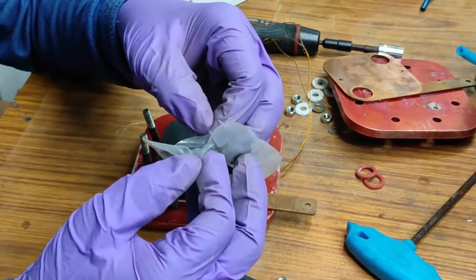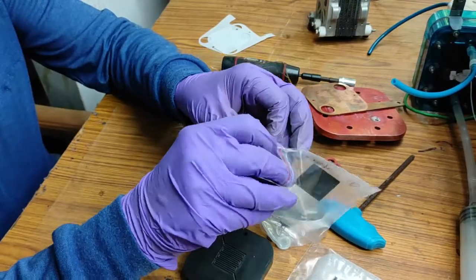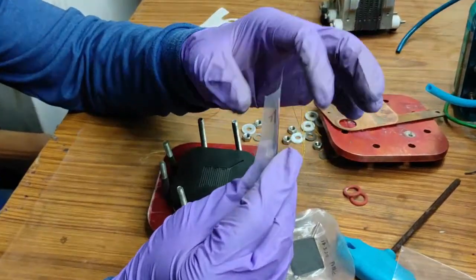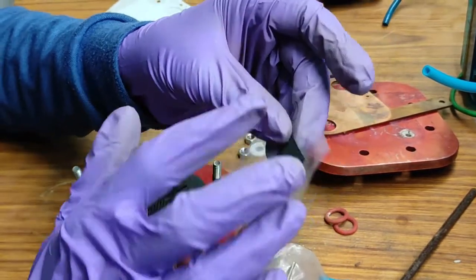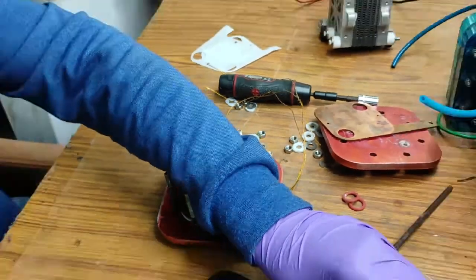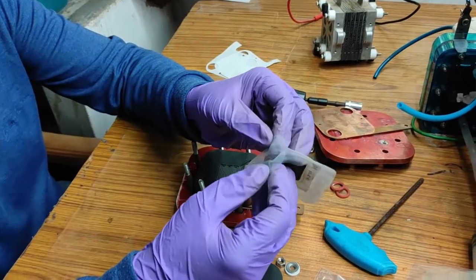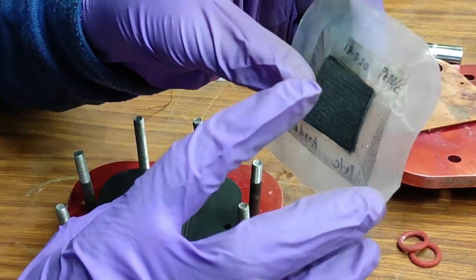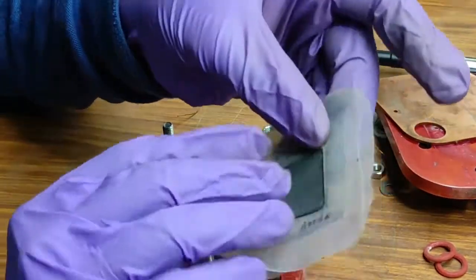Here you can see the silicon rubber. In a single MEA like this, there is a membrane, and this is the electrode — anode or cathode — of the fuel cell. This is simply a carbon cloth. In the MEA you need a gasket on one side and also on the other side — on the anode side and on the cathode side. The gasket is a silicon rubber. I have fixed a silicon gasket on the MEA, so if I flow any reactant gases they should not go to the other side or leak on the same side.